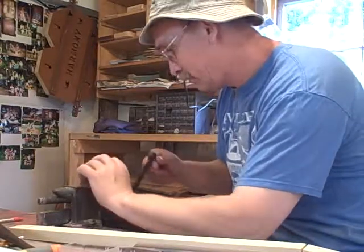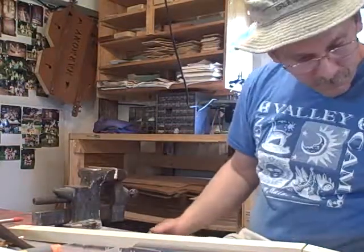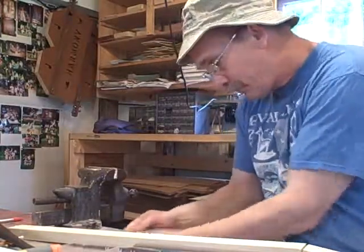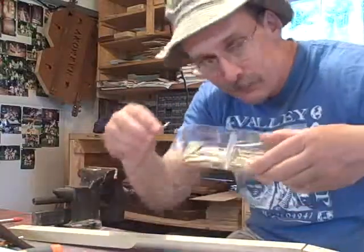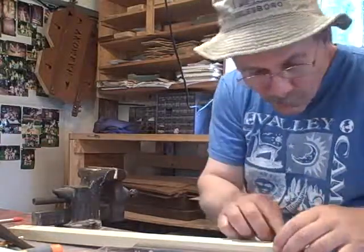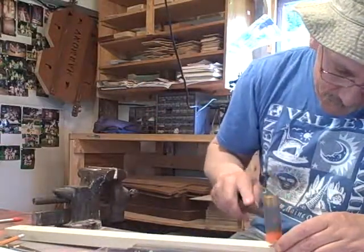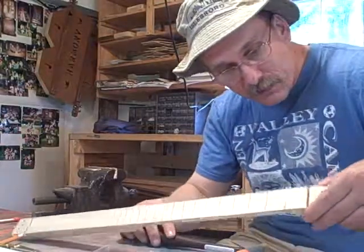I got some of that gorilla glue on my fingers and that ain't no good — it's good glue but you don't want it on your fingers, so you just rub it off onto a dusty surface and most of it kind of dissipates anyway. I've got a thing full of frets here — these are frets I've cut from fret wire. They come in long pieces and I cut them to fit the neck. Then what I do is take this fret hammer — it's got a plastic end and a nylon end, the other is brass. You really got to give her a good whack with the brass, but usually use the plastic so it don't dent the fret itself. Tap it a couple times and you see the frets go in there just like that.